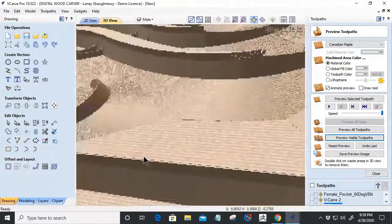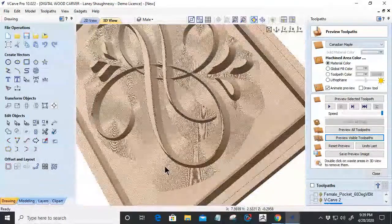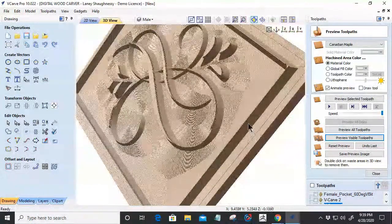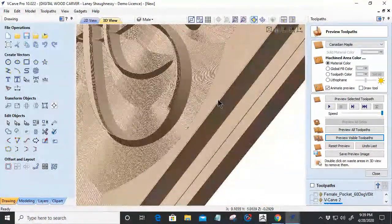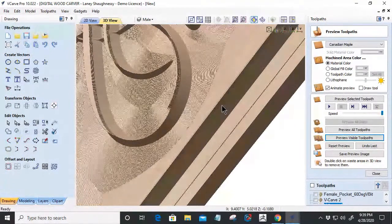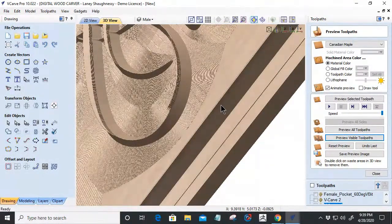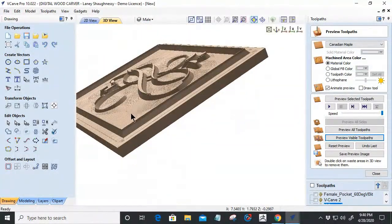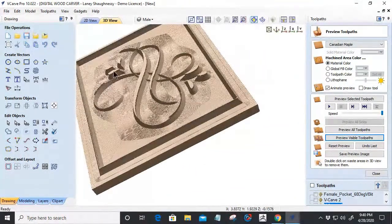let me see if I can find a better angle. I should have probably turned up the volume on the pixelation here so it would be a little bit more clear for you. But on this lip here, my V stops right about here where that light tan area is, and then this is all straight meat, right? It'll go down in there probably, but it's holding all my other parts up in the air. So if you get that straight edge there, you've exceeded your cut depth on your bit, and that inlay is not gonna work for you.